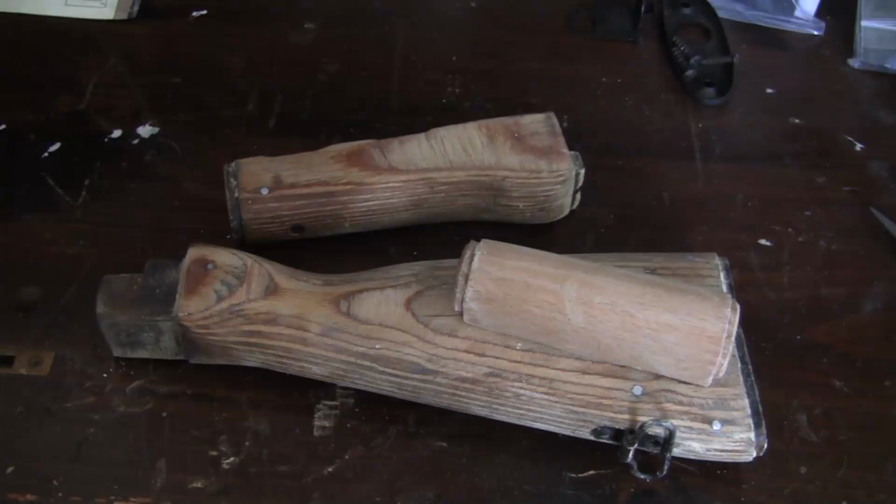So using a light stain, I probably wouldn't recommend it on this stock set because you're really going to see that really ugly grain, and it's not going to match. So I'll probably go with a medium or a darker set on this. I have no idea what kind of stain I want to do, so I'm going to run to Lowe's here in a minute and go see what kind of stains they got and go pick one.